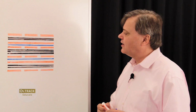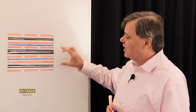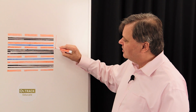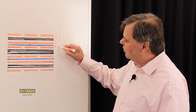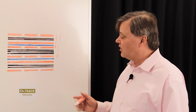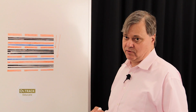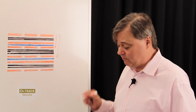Okay, another thing you need to consider are your via stacks. Now, in looking at this layer stack up, this upper portion and this lower portion could be created as subassemblies. These could be placed on a drill machine. They could be drilled and plated individually. So we could use blind vias from the top layer down to our first high-speed signal layer. However, what about this layer? Once this has all been laminated with the pre-preg material in the center, that's a difficult layer to get to. That's going to have to be laser drilled and plated, adding significant cost to the overall design. So the most inexpensive way to design this board would be to use through-hole vias.